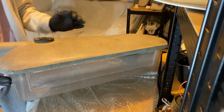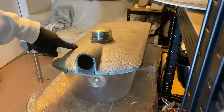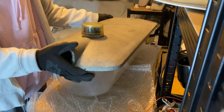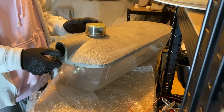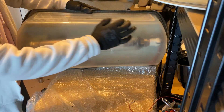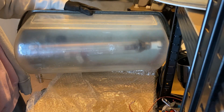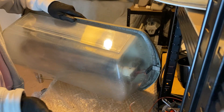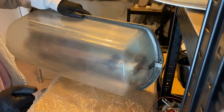So that is a teardown of the Alpha 9 — a very simple lantern. There were integral versions of this lantern. Although this one is remote geared, there were integral ones made. The earlier integral examples featured a much longer spigot section and the canopy was slightly larger to accommodate the gear. Usually the bowl was a much deeper one. Ironically, even with all that open empty space inside, with the position of the lamp there really wasn't any realistic place you could put the gear. So the geared versions had a deeper bowl usually, and the lamp holder bracket was longer so that the lamp sat lower in the bowl and the gear was situated above the lamp.